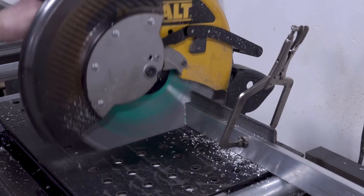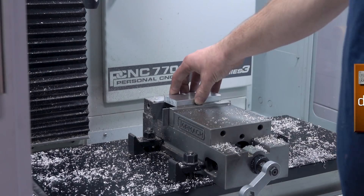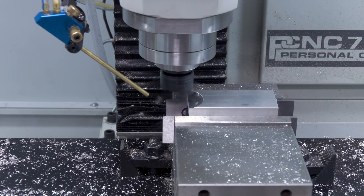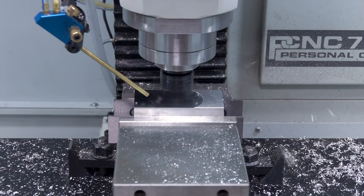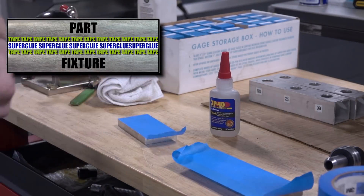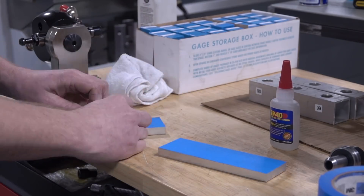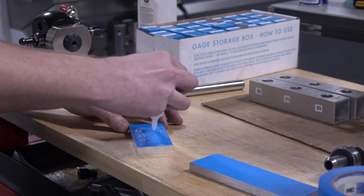Starting with the same size raw material from last week's differential bar, we're superflying it down to get a finished surface. This will be the underside, and it ensures we've got a really flat surface for the superglue trick. One of the things to remember with the superglue trick is the sandwich of part, then tape, then superglue, then tape, then fixture. We continue to love this technique. We have found a single better superglue for flood coolant.